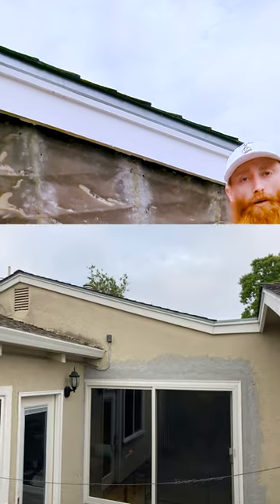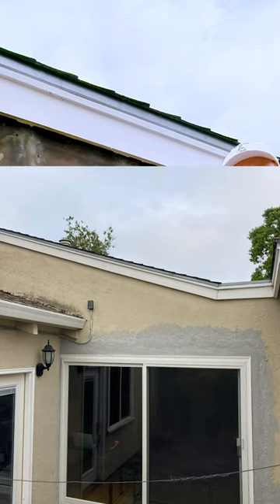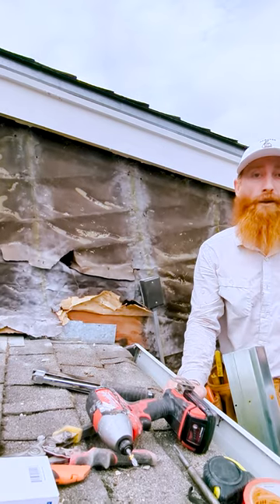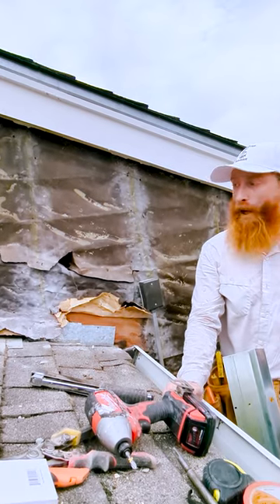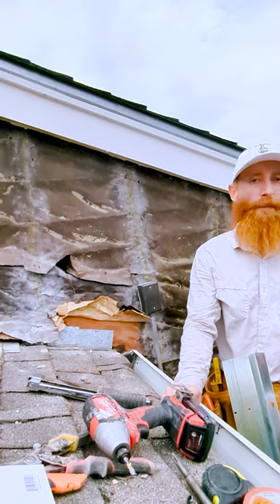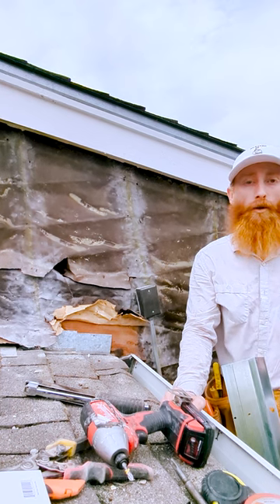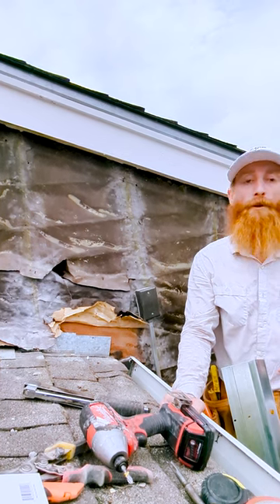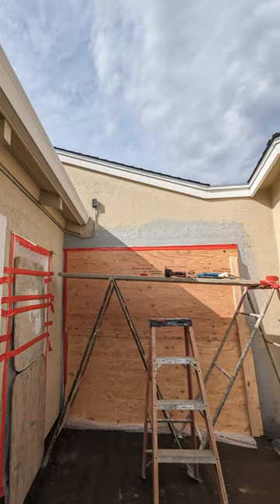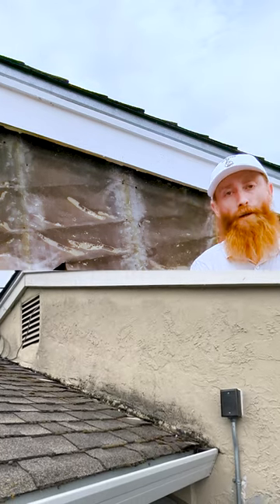This fella had a new door installed. I'll show you a couple photos of this — it's hard to film and do it all myself. This is one of my jobs. What happened is that they installed this new beautiful door and all the paper above it was completely deteriorated. The door installers — it's not their job to tear apart the stucco and identify what the problem was, that this roof-to-wall area did not have a diverter.